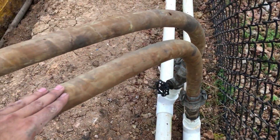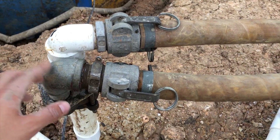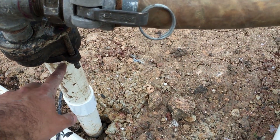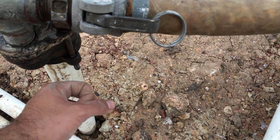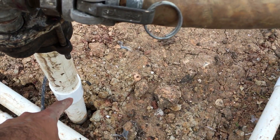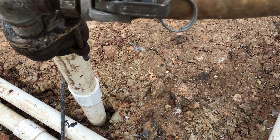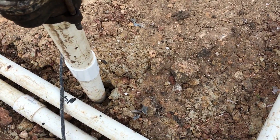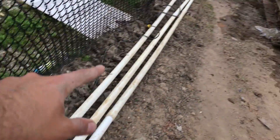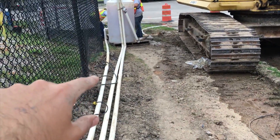Water pressure comes in through here. There's a metal fitting — that's the pressure line with the metal fitting — goes in through here. And the blue piece of pipe, about this long, comes to a point and shoots it down. The system is at about 22 to 25 feet, and it comes back by venturi action back into the water. There's two on the right, one on the left — that's the pressure line.